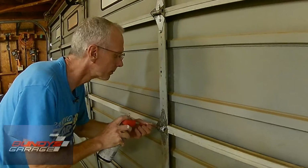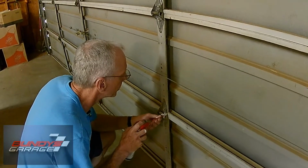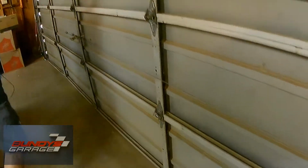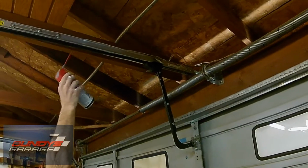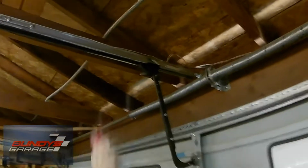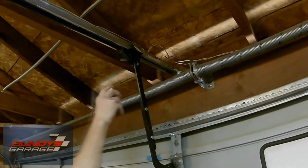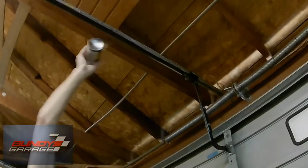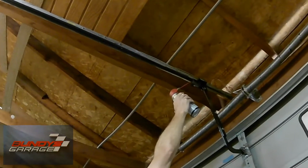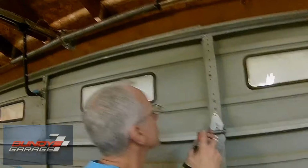Do you think this is the only grease you should use? Well, for your opener here, that's where you put a heavier duty grease. Some kind of heavy grease would go in there, and you've got a worm drive there. The worm drive's spinning and there are teeth on this, and it just slides along there, grabbing, so you lube that up really good so that it's going back and forth. Any particular grease you recommend? Oh, I'm no expert on grease, so, but...